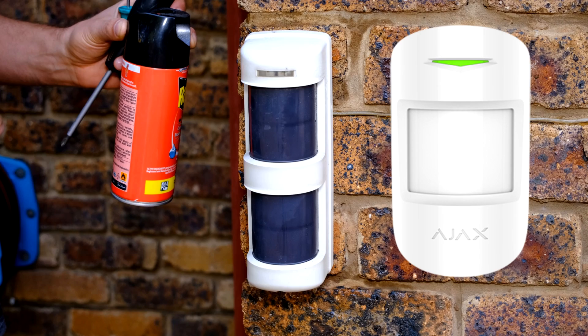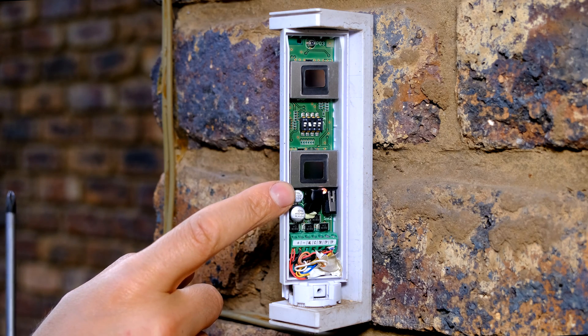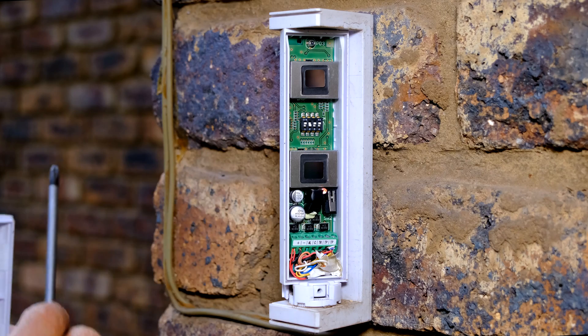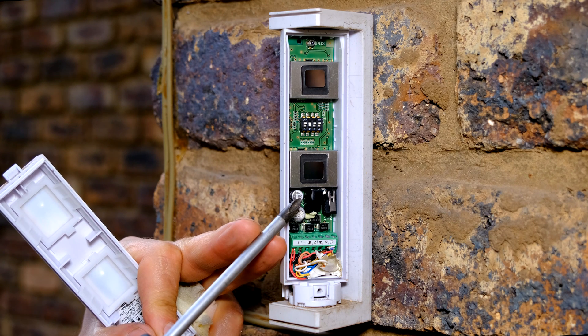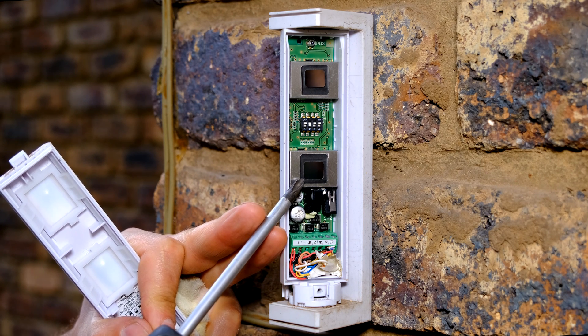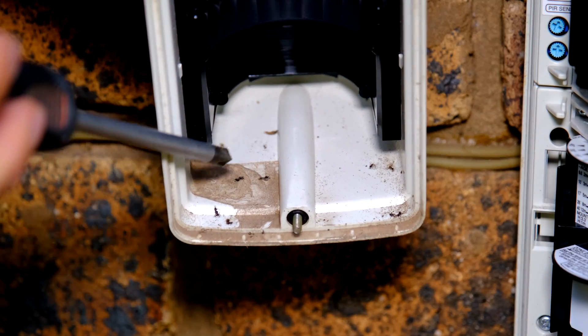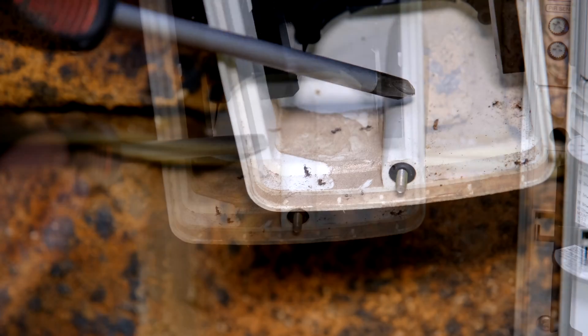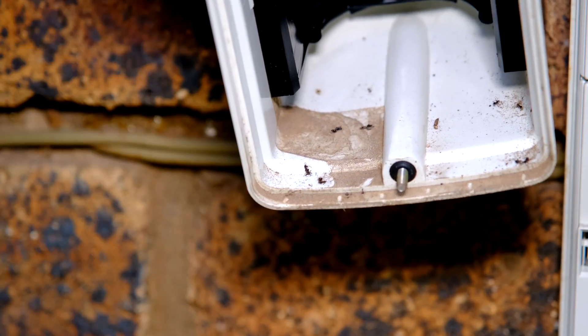I've just opened another one and I do see a dead ant here. What I want to bring to attention is that these infrared sensors must not be touched, so please be very careful and never spray insecticide inside. One of the reasons small insects can trigger the alarm is that being very close to the sensor is almost like a big object quite far away — so a couple of ants walking on the front of the sensor will cause a false alarm. This one is not as bad, though there are some dead ants and what looks like a sack from another insect that was living here. The point remains: seal up your sensors so you don't get false alarms.